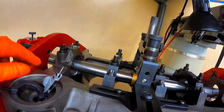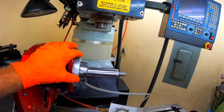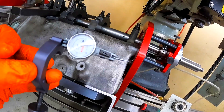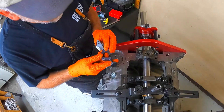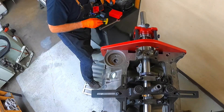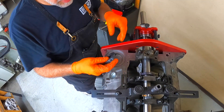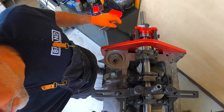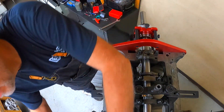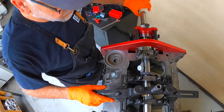Got the centering rings out. The bar is nice and free now. Got about 30 pounds of air pressure on the little bearings here. You get a little clamp — clamps around the bar — you mount your indicator too. It's a well thought out setup. The indicator clamps on the bar. Also, they have these little rings which slide over the end of the bar on each end, and you can snug them all up to keep the bar from moving back and forth when you're indicating it in.